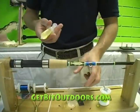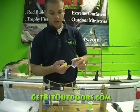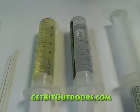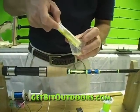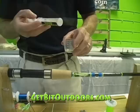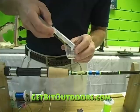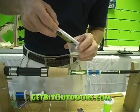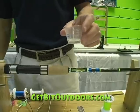The nice thing about these syringe kits is I don't have to eyeball and make sure I've got a 50/50 mix. Based on these measurements on my mixing cup, I have those measurements right here on the syringe. You can see the syringe is loaded to 12 milliliters. I'm going to put two milliliters in the cup, bringing it down to 10. Double check my other syringe — it is at 12 — and squeeze two more milliliters of the second part. We're at 10 now, so I know for sure I have a 50/50 equal mix.